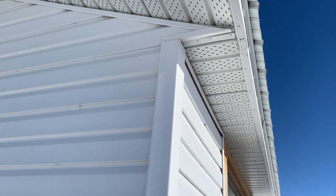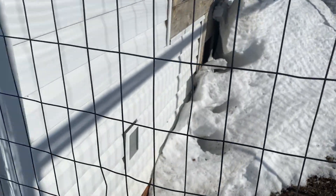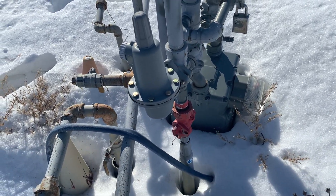Even the chicken coop is passive solar. It's a little bit of a cross between how you do a house and a greenhouse — there are no plants that need full summer sun, but the chicken coop and barns are opened up a little for ventilation. Animals aren't the cleanest things and it can get smelly in there, so they need fresh air. On the chicken coop it's a little bit less of an overhang, so it gets a little summer sun, but it's opened up. Won't be needing any natural gas today — it's only minus 20 and the sun's out.